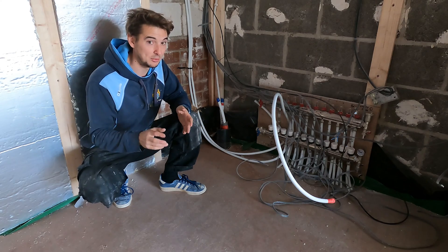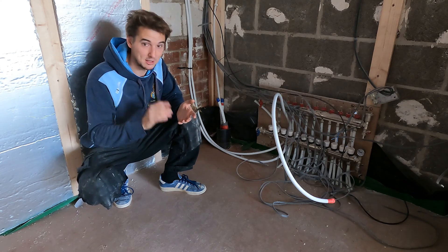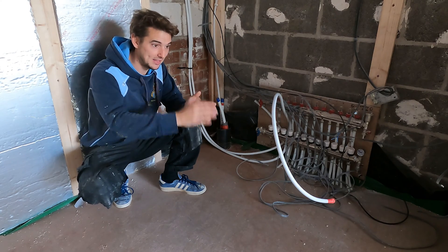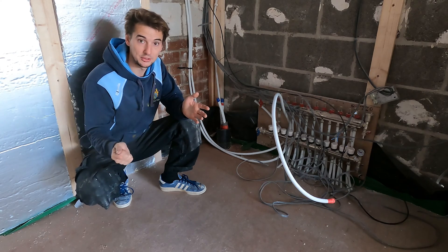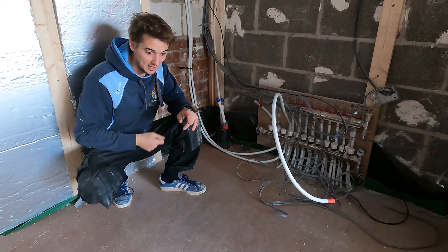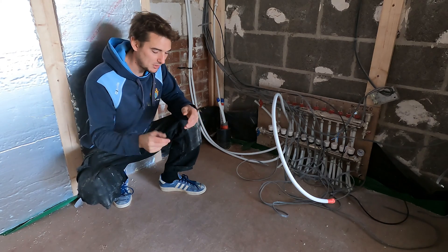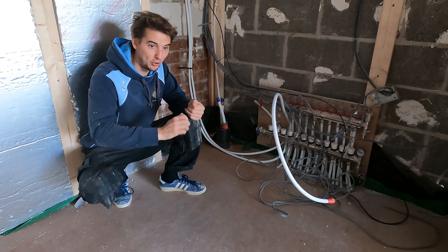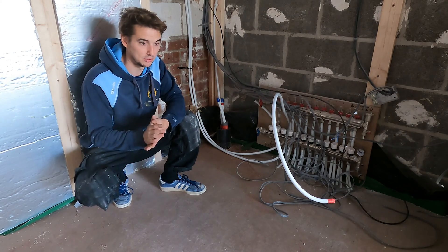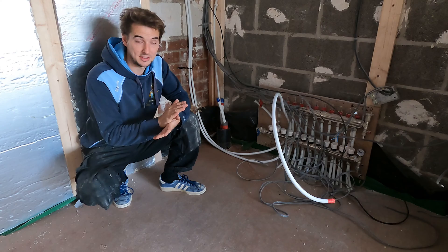What Omni offers in terms of their boards is much, much better. Their boards allow the pipe to go in multiple directions — you're not restricted to one direction like I am. You can go left, right, up, down, sideways, and curve it back — much better in that respect. Also, they've already got integrated heat foil within the boards, so you don't have to do the separate step of hammering in all those metal foil trays. That aspect is a clear winner.